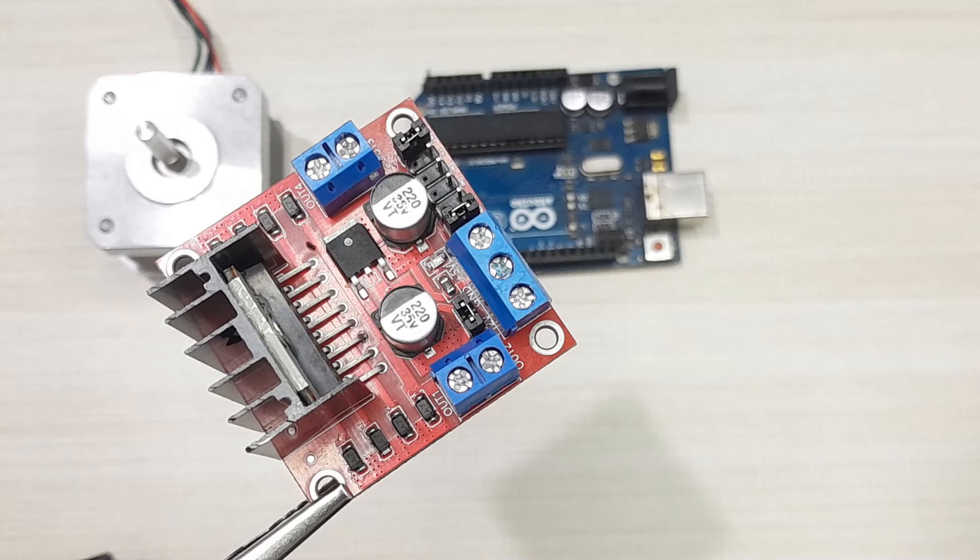The major challenge of using the L298N motor driver to drive stepper motors is that it has no easy way of setting a current limit, unlike other stepper motor drivers like the A4988 or DRV8825. I have talked about these drivers in my other tutorials, with links in the description below. The rated voltage of the L298N is from 4.8 to 35 volts and can supply a maximum of 2 amps per phase. The motor you use should work within this voltage range and not exceed the rated current, otherwise excessive heat can damage the motor driver and the motor itself.